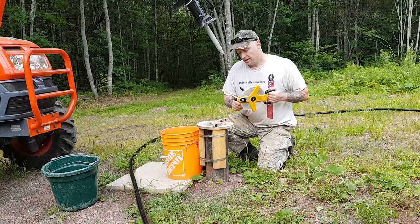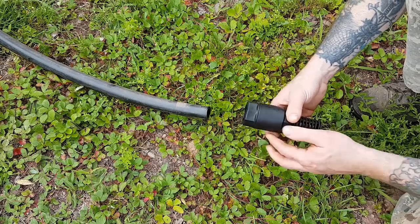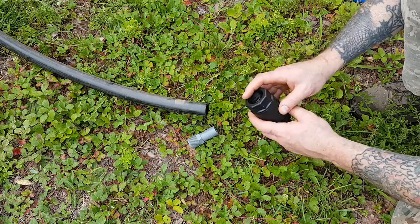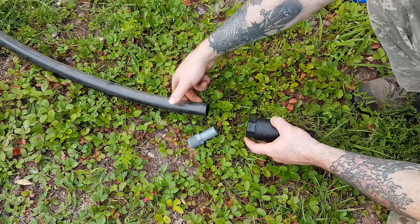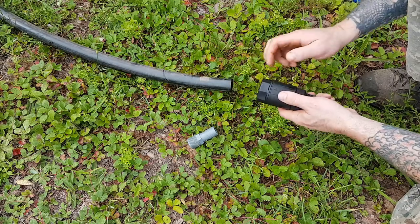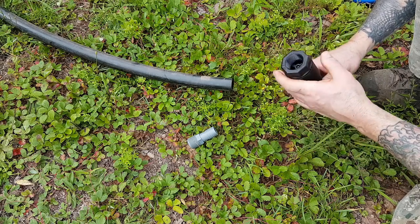13 feet is not too bad — I still have 10 more feet of capacity. This is my new foot valve. It goes into the bottom of the pipe, acts as a strainer to filter out anything you don't want coming up, and it only allows water to flow one way — up towards the surface. When you prime the well and fill the pipe with water, the water won't go back down, creating a vacuum so you can pump water up to the surface and maintain your prime.